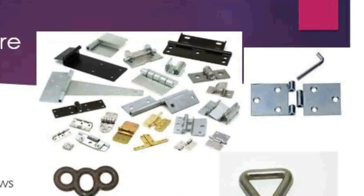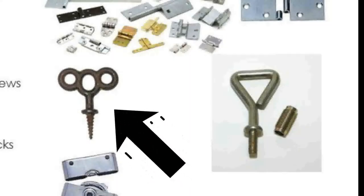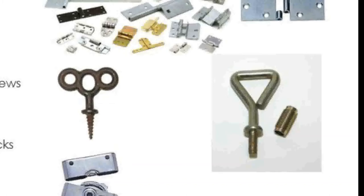We pull the pin out and then we can carry the scenery away. The next thing is called a stage screw. This Mickey Mouse looking one over here to the left with the point to it is the old stage screw. It works like a screw — it has the point so it can drive its way in. You would drill a hole slightly smaller than a bit of the way down the stage screw itself to get it started, then crank it down to fasten something like a stage jack to the stage. It can be pulled up relatively quickly for a stage shift or changeover. It's a quick and dirty way to fasten something down semi-permanently without needing a bolt or a lag screw and a tool.